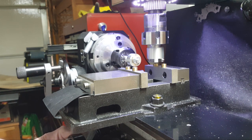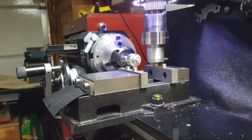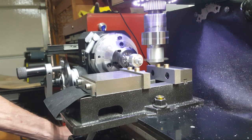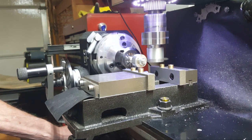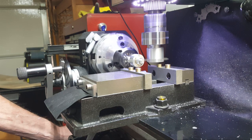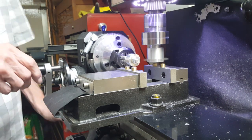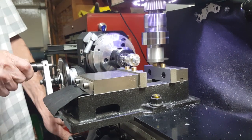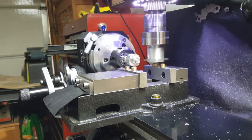Just for the heck of it, a slight scratch cut — three thousandths — let's see what happens. It's hitting it. I double-checked the spreadsheet: four and four is what you're supposed to do. One, two, three — removed it — four and four. It's back on there. Now move that forward and do it again.